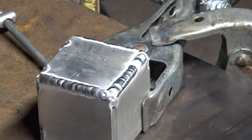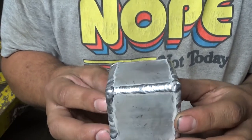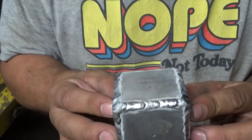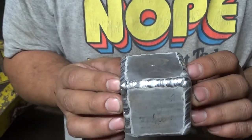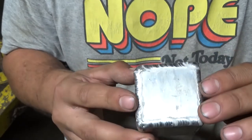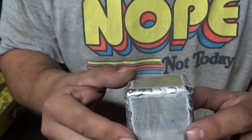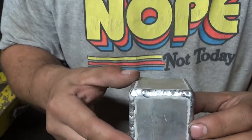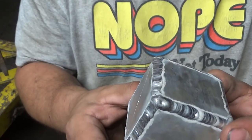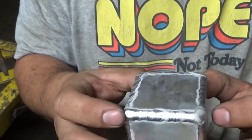They're coming out all right. I'm leaving small craters — I'm trying not to do that, but I'm still a beginner. That's enough for the arc shots. Here's the final product. I want to go ahead and show all the welds and all my mistakes. The corners — I tied them in, but left some little crater holes. Not good.